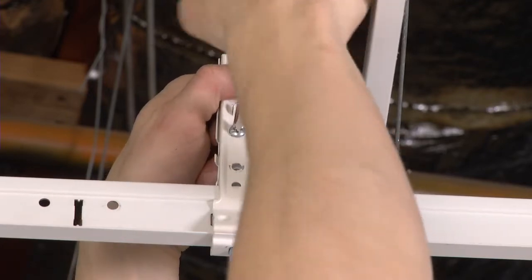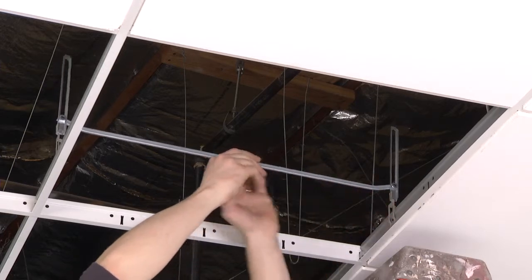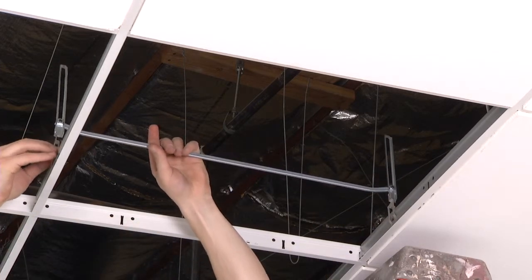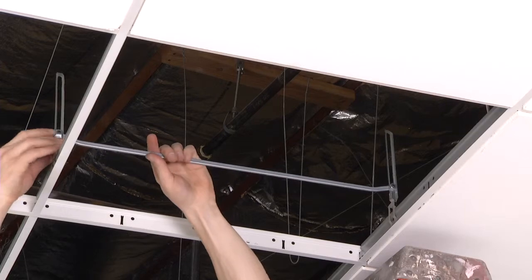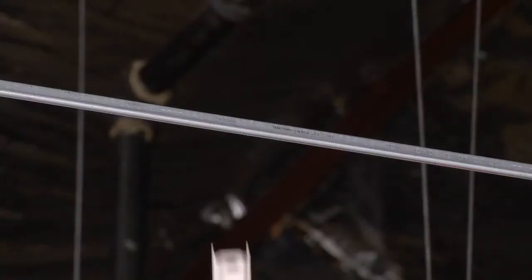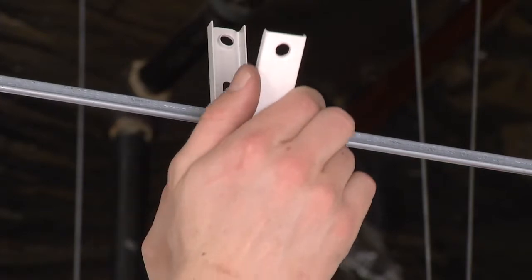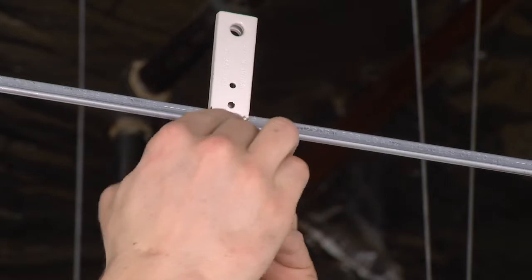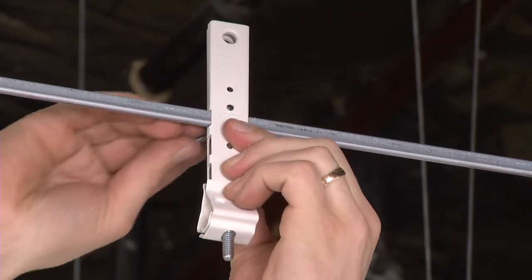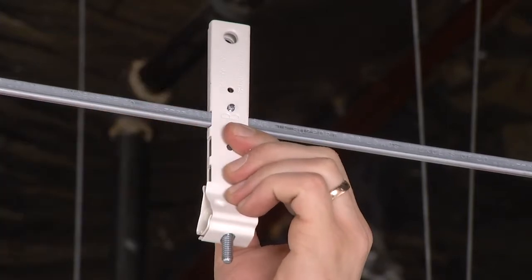For off-grid installations within ceiling tiles, clip a hanger bar, Caddy 512A or equivalent, to the ceiling grid. Then, simply attach the universal mounting bracket to the hanger bar using the tabs for alignment, and secure sides A and B of the bracket with a single screw. For feed locations, attach a J-box to the bracket as previously described.